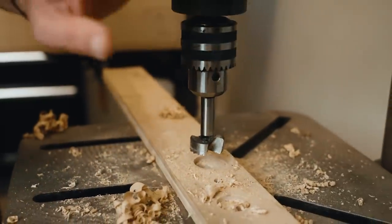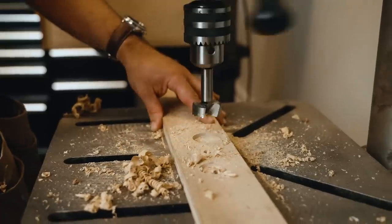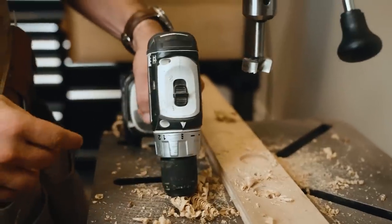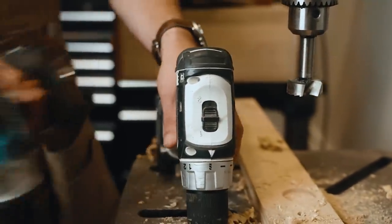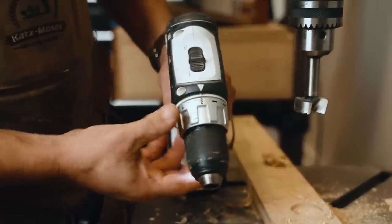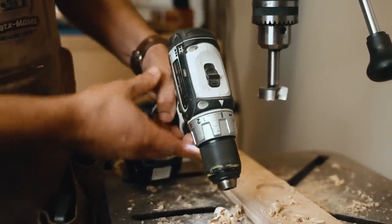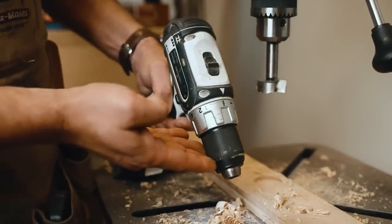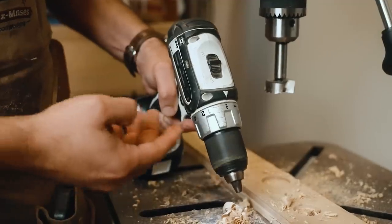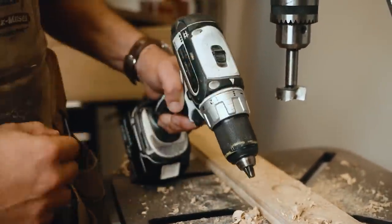You want to keep it from heating up because heat is the enemy of sharpness. Go down, pick it up, go down, pick it up — and that applies the same if you're using a drill. For a speed comparison: most drills have two settings. The slow setting is zero to 500 RPM, so a full trigger depress is 500. The fast setting goes zero to 2000 RPM. That'll give you a good reference if your drill press doesn't have numbered dials.